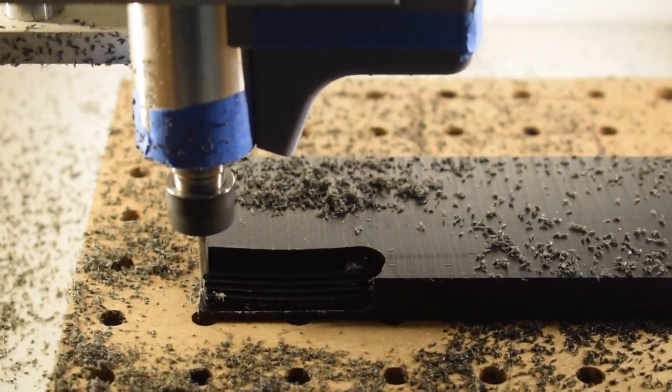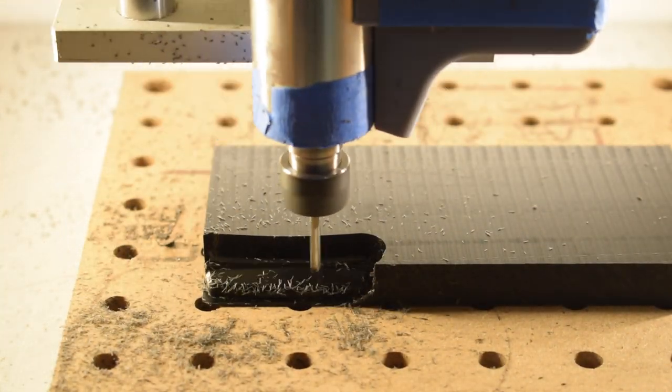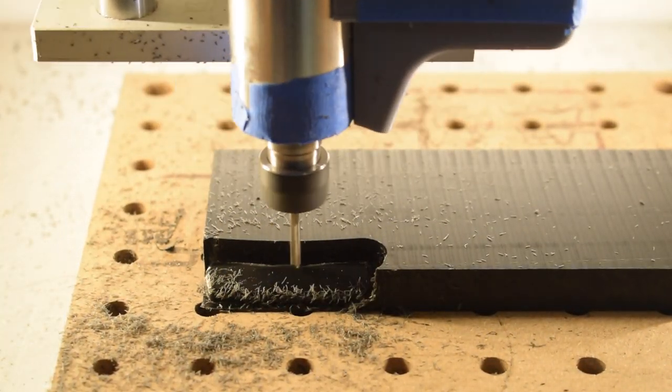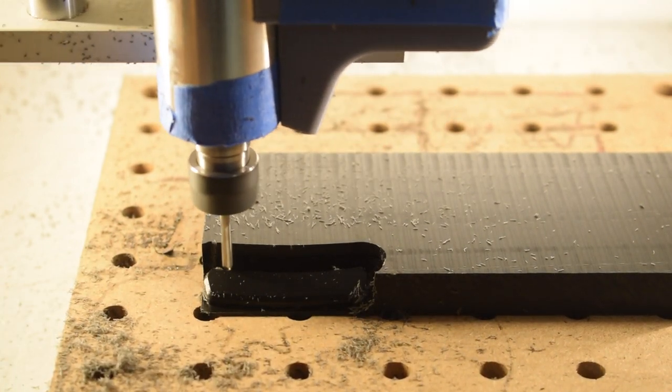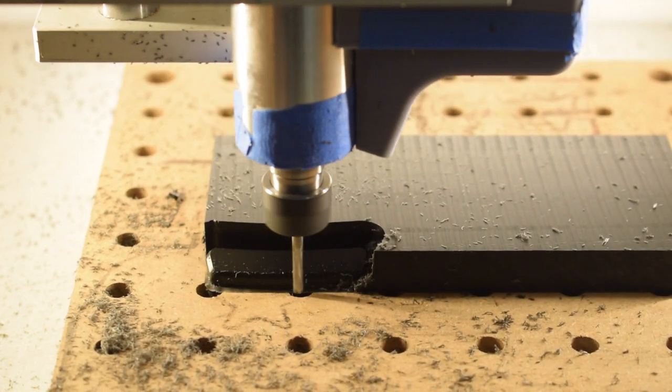On the first pad, I had to dial in my radial stock to leave with that contour finishing pass around the outside. I wanted to achieve a fit that was just barely snug. Friction and double-sided tape would be all that would hold this pad in the board. Surface finish on this part was unsurprisingly excellent because Delrin is awesome like that.